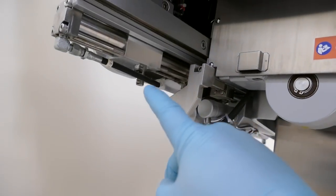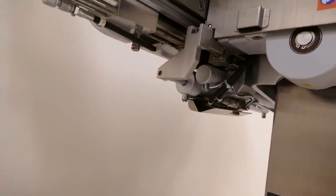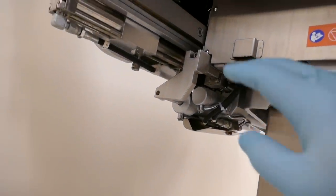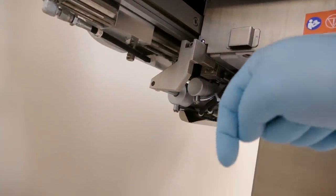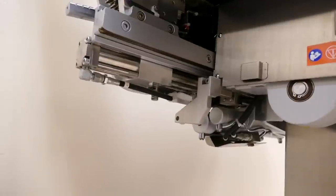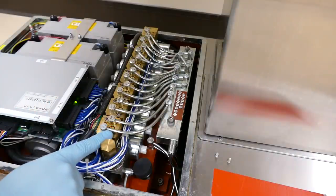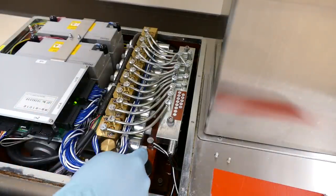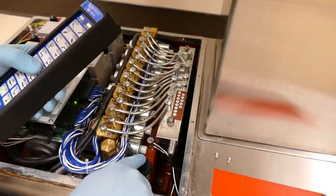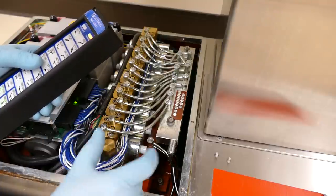The first step to this repair is to clean off that hydraulic shaft by unwrapping the tape and cleaning it off as best you can. But if it's truly stuttering really bad, you first have to clean out the hydraulic block, which will open up the passage and allow the table to move. We're going to tear into the hydraulic system right now. This first hydraulic block is the one that controls table slide — you find it by hitting the table slide buttons on the controller and watching which end cap gets darker as the solenoid moves back and forth.